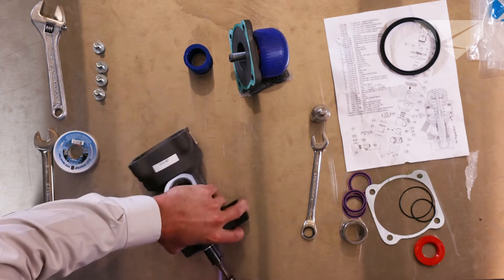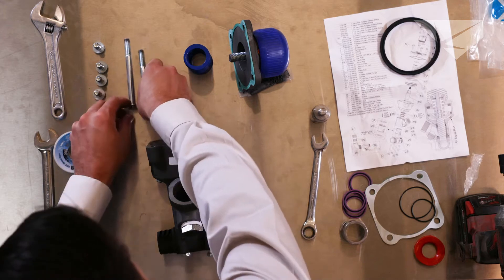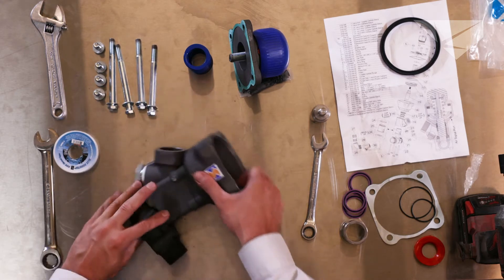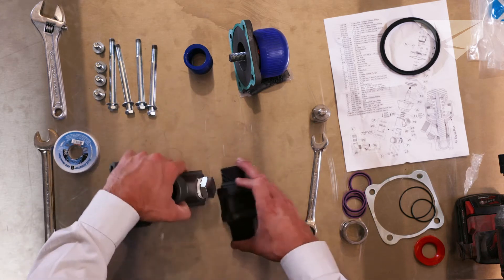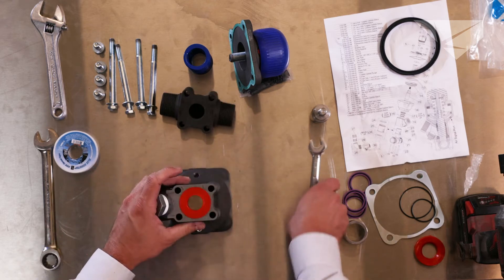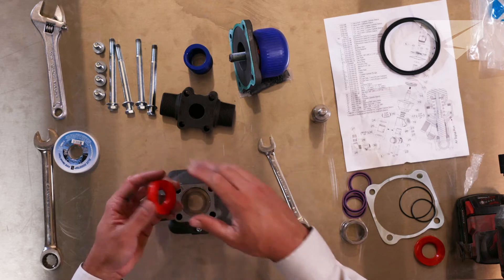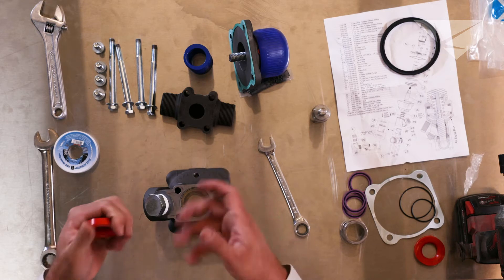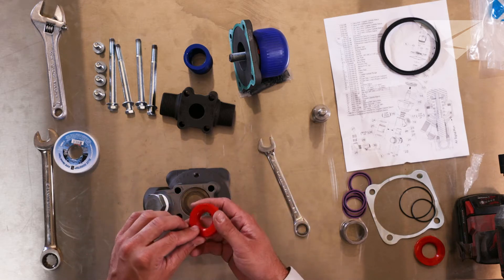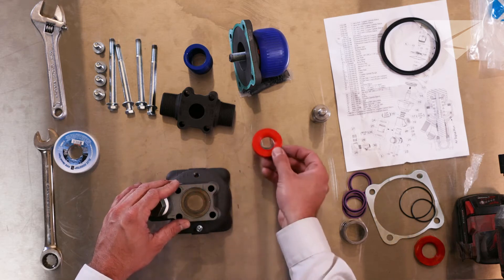Then we're going to move to the bottom of the valve and pull off the base. Once you remove the base, you inspect for any wear that may be going on around the hole. Then you turn the valve upside down, use your wrench, and pull out the urethane seat. The seat is a common replacement item in the field. You'll notice if a valve starts having blow-by or a lot of chugging when they first start up the blast hose but then it goes to normal after that. What happens is you get a rut dug in the seat and the piston cannot seal properly, so it allows a very small amount of abrasive through the valve. Inspect and make sure it's the same all the way around with no ruts dug in the seat. These are cheap and keeping up on simple seat replacement will fix a lot of issues.